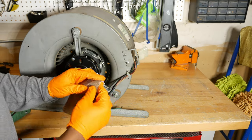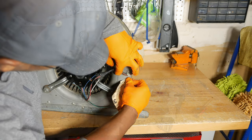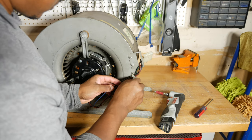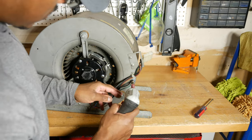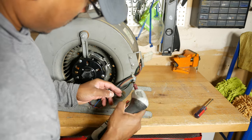The last thing to do before reinstalling the blower in the furnace cabinet was to attach the ground wire — no ground was included on the Westinghouse motor. I sanded off some of the coating in a small area to expose bare metal, and I had to add a washer under the screw's head because the screw bottomed out and just spun freely on the thin sheet metal.